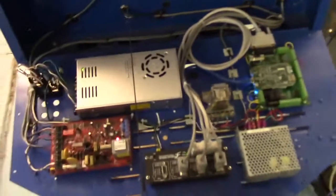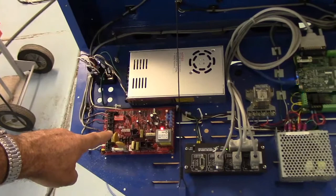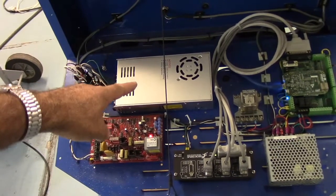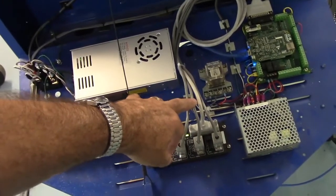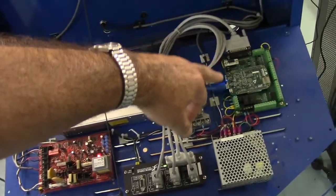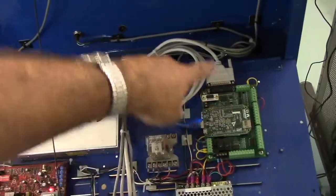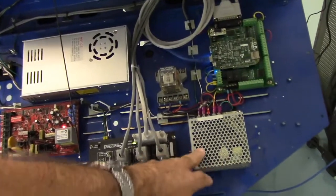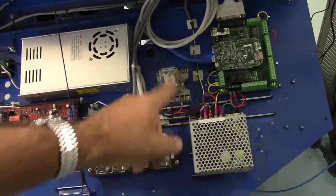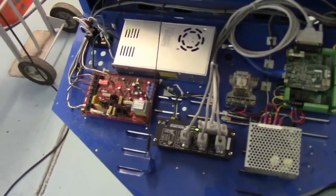Let me take you around to the back to the control. Right here you have the DC spindle controller, got a 48-volt power supply there. You've got the Gecko G540 stepper driver here, and then you see the DB25 cable — it circles around and plugs right into the Acorn. That's the Acorn motion controller: four-axis step and direction. All the step and direction signals go to the G540 through the DB25 cable. This is the power supply for the Acorn board, and I'm grabbing 24 volts for a relay here.